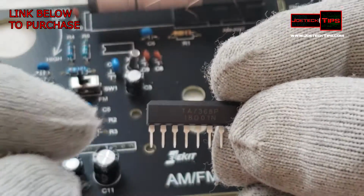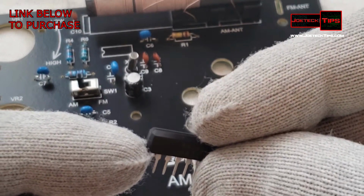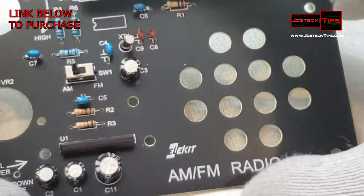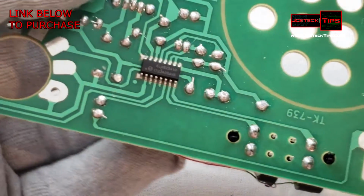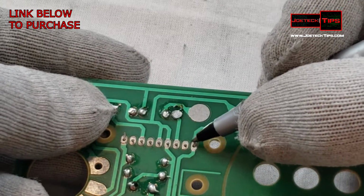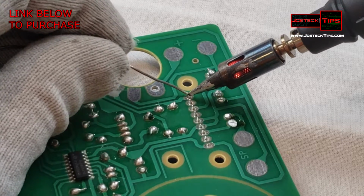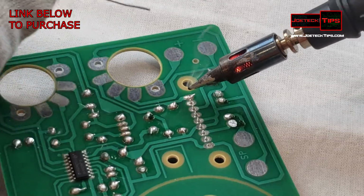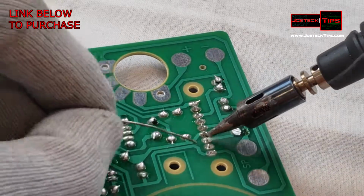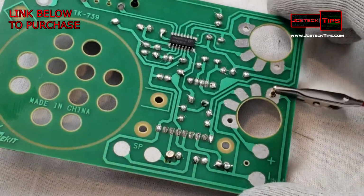See, there's a direction. You notice there's a little slant on this chip here, right there. That would indicate pin number 1. Notice there's no slant on this side here. So we're going to install it like this. Okay. Like that. Spin this around, and we're going to bend 2 pins, 1 on each side. Not cooperating. See if I can knock this out quickly here. I need a good angle here. I don't want to blow this chip up with excessive heat, so it's important that we do this fast. Okay, done. I don't smell anything burning, do you? Except for the solder.